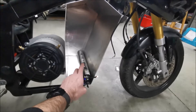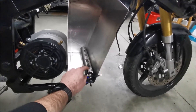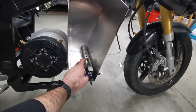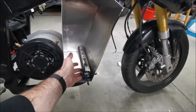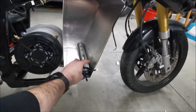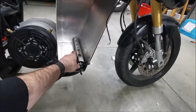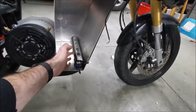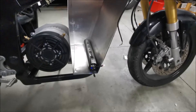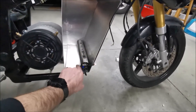I managed to get 30 of these tubes, each containing 20 18650 lithium-ion cells — very good quality 10-amp Samsung cells. Each tube at 37 volts will happily deliver 10 amps with no problem. The capacity numbers I've written on them, like 4791, mean that at a 5-amp discharge rate these tubes are getting almost 5 amp-hours capacity. That's pretty spectacular, and at a very good price too.